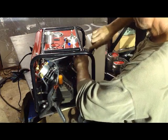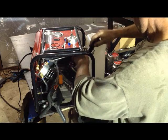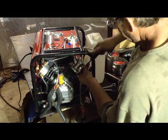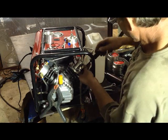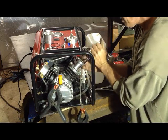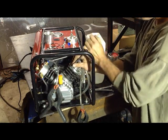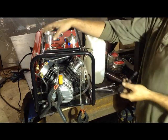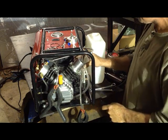I like to run all the bolts down just touching first before I snug any of them up, to keep from getting anything cocked sideways. If you feel any resistance, stop. As I said, put anti-seize on them — it does not need to be super tight. It has a nice thick gasket, and the cylinder pressure underneath is not high pressure. Tighten those down, then you're ready to put back on your water jacket — it just slides right over. It doesn't hurt to put a little silicone grease on those o-rings.